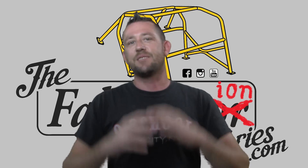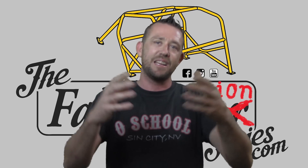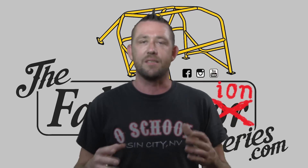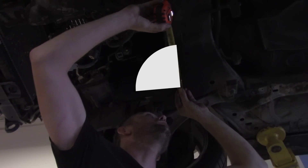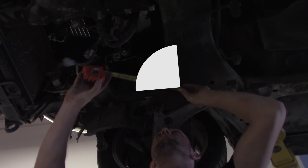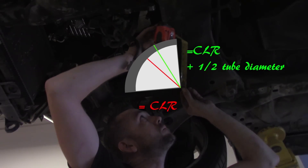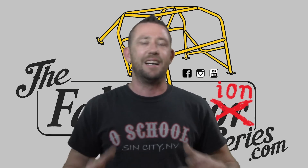Either way, last and final question: how do you actually calculate the center line radius, or how do you figure out what kind of assembly angle you need to put together? Well, there's actually a science to it, but there's an easier way of doing this, and this is at least the way that I do it. I just kind of eyeball it with a tape measure, and here is a very brief summary of exactly how I do that. I typically just grab my tape measure and stick it to a point of reference where I feel like the tube needs to swing. The white section is actually the center line of what I'm referencing off of. When I'm eyeballing it, I usually look for the outside of the tube — that would be the gray section. Shown in green here, center line radius plus half the tube diameter is the outside area or swing of the actual tube itself. And then on the inside, on the white section, that's the actual center line radius. So, pie cuts — you have everything you need to know. Let's see you get out there and do it.